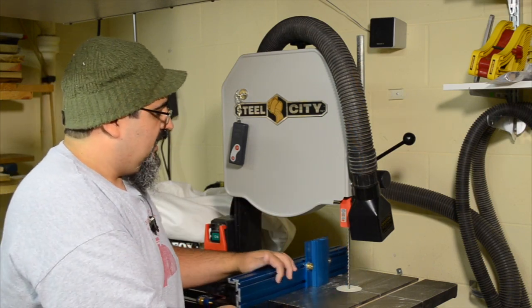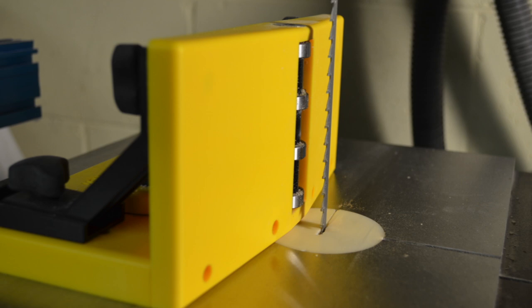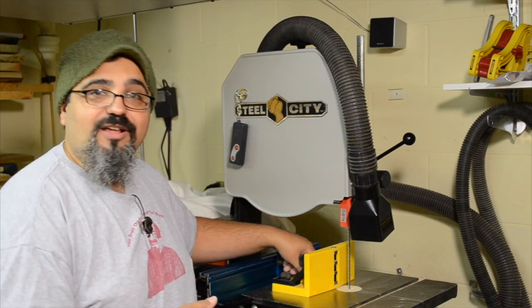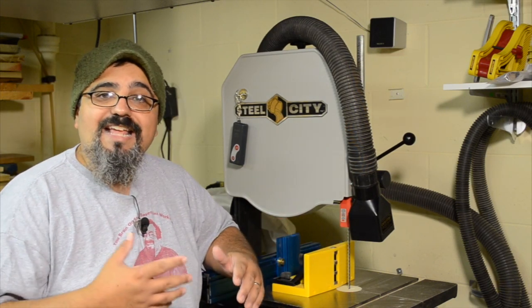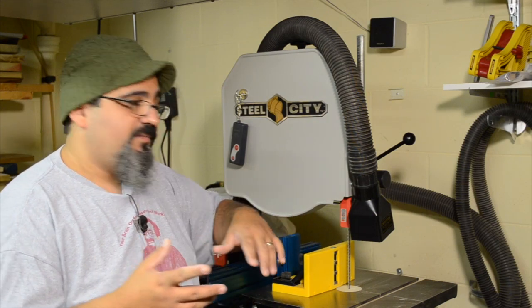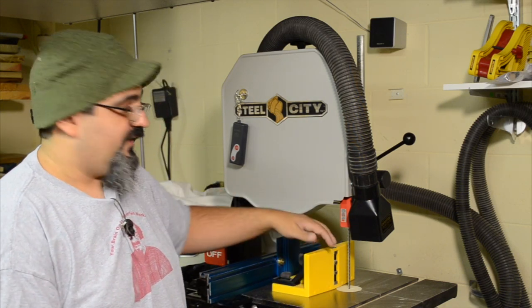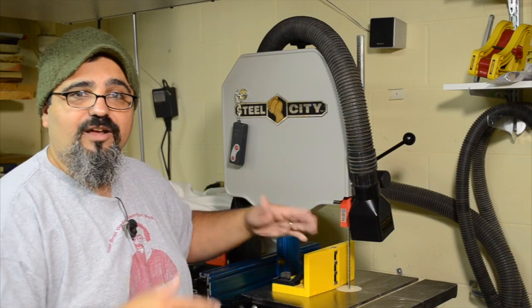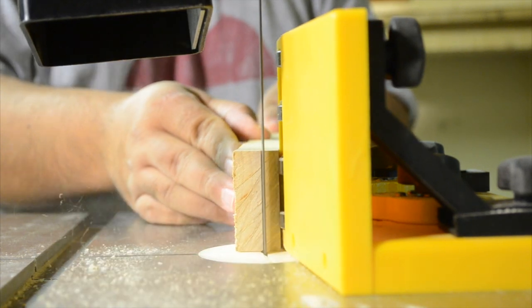This is the Craig jig. You can also make your own jigs for the single point. I recently had a chance to try out the MagSwitch single point and I really like it. You just put the jig in place with the magnets, it runs right up against there, and it gives me the same exact quality of cut as my Craig. One nice thing about the MagSwitch is you have just a little bit more face here — I've even found myself running the board right up against it almost like a fence, and it still kind of feels like it's going right into place. I'll show you exactly what I mean in the footage — how we get the board onto that single point between the blade and the jig.